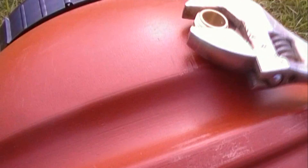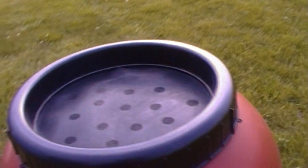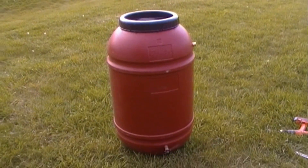The idea with this is to put about six to eight feet of garden hose on it, with some window screen on the end, so it can divert the excess water away from the barrel. There may be instances where that overflow won't evacuate enough water coming in from the downspout, and you'll have to watch for that and adjust accordingly.